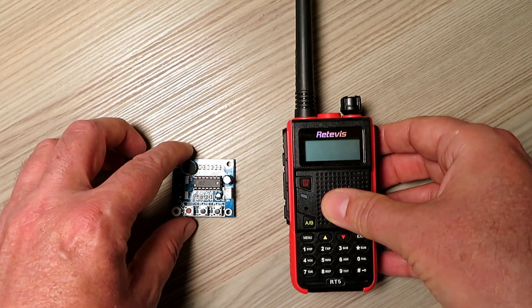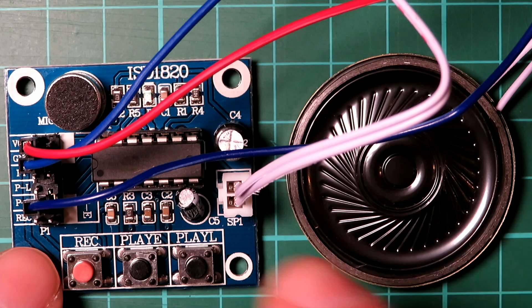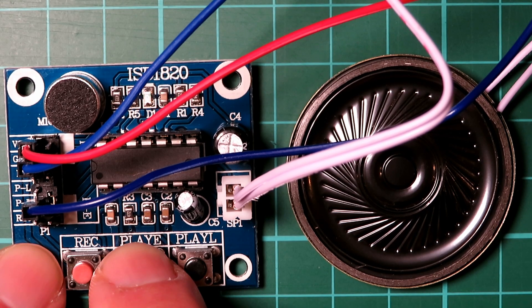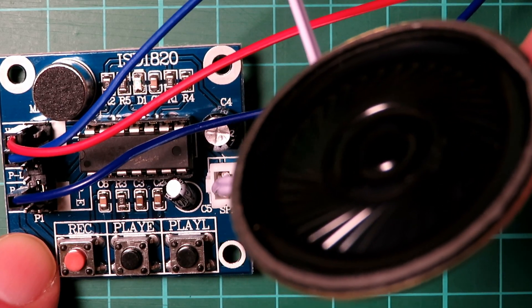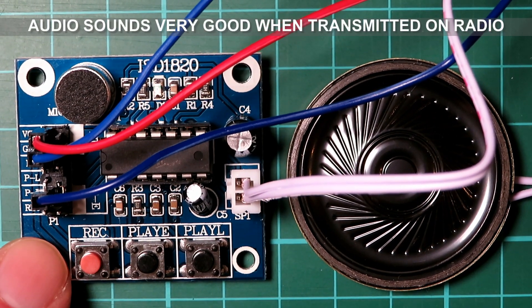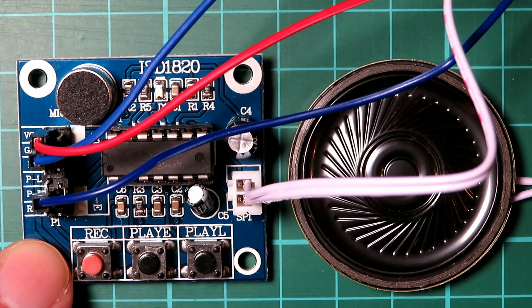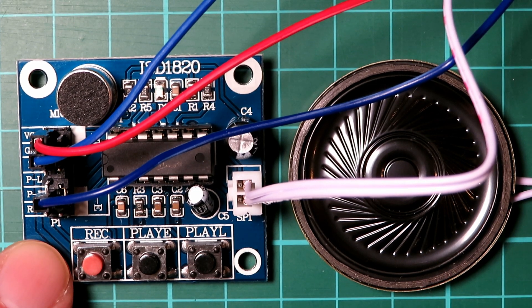It comes with a very cheap speaker, but this is just a quick recording I did — I'll play it back so you can see the quality you get with the included speaker. It's not the best quality, but actually there's a little bit too much power to drive straight into the radio, so I rigged up a potentiometer in line with it and worked out that about a 4.2k resistor in series was needed just to knock the edge off and prevent it from overloading the radio circuit. So let's show you the whole thing connected up with the radios and quickly go through how it all works.